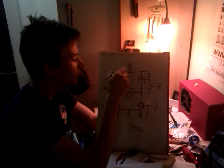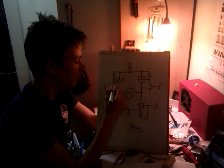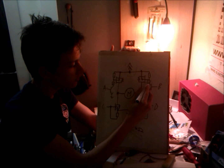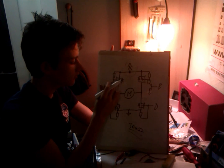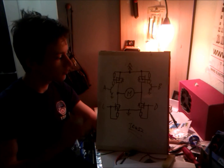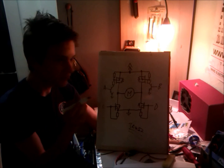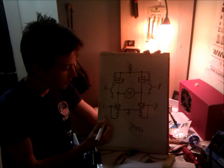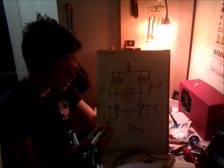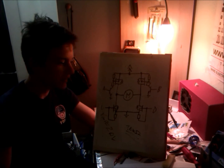And I'd also like to note one thing. If you're working with voltages higher than the max gate voltage, then at the P channel you should add another resistor between this resistor pulling things down and the resistor driving the gate, in a ratio calculated as a voltage divider, so that it won't hurt the transistor's gate. But since the maximum voltage on the gate is about 20 volts at most MOSFETs, this is not really a problem.